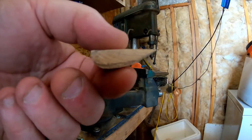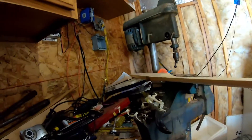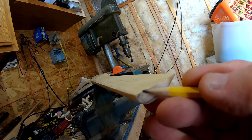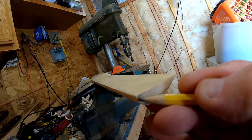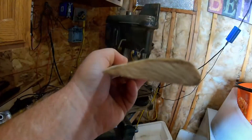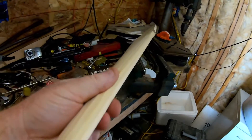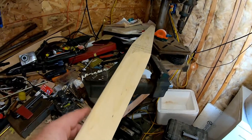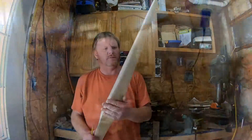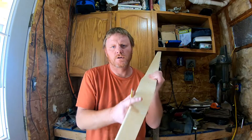We're almost there. We're going to take that sharp edge off and round that over to make it more like an airfoil — just tip that corner and round it over, it'll help a lot with the airfoil. As you can see, that's the basic shape. We want to maintain that shape the best we can all the way down. Now one thing left to do is carve the other side — both sides carved out and we've got our airfoil.